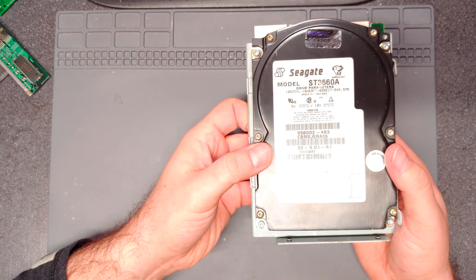Fortunately I can salvage the RAM, the Overdrive CPU, an AT power supply, this ISA riser card which should be fairly universal, a 500MB hard drive - the smallest I have right now is 1.2GB so that'll be nice for retro systems - an extra floppy disk drive and optical drive if both work, and a nice case if I can find a replacement board. The only one I can find on eBay right now has the same amount of corrosion unfortunately. There are the 440 and 440T boards which should be the same format. If you have any tips for cleaning this mess or leads on a replacement board in good shape, let me know - and thanks, I'll catch you later.